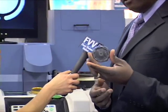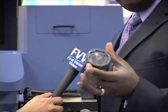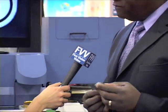Onyx Bond is friendly to the Earth. This new proprietary material is going to replace alloy and also another substance called freebond or wax. What's nice about it is it allows a little bit of flexibility but it's very rigid in the areas in which you're going to be processing your lens. This material is reusable — you can cut into it, which saves on your machines. You simply take it back after de-blocking, put it back into the machine, and it remelts it and allows you to use it for other jobs as you go along.